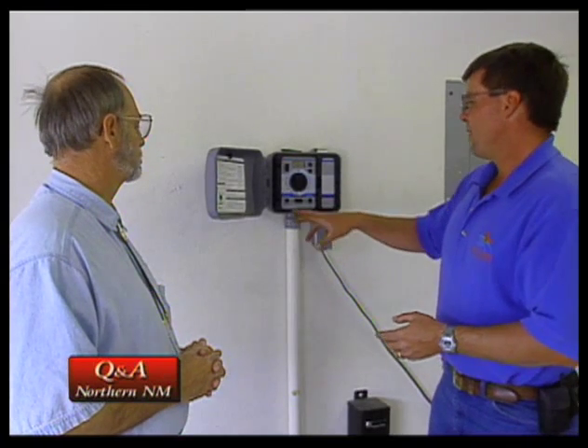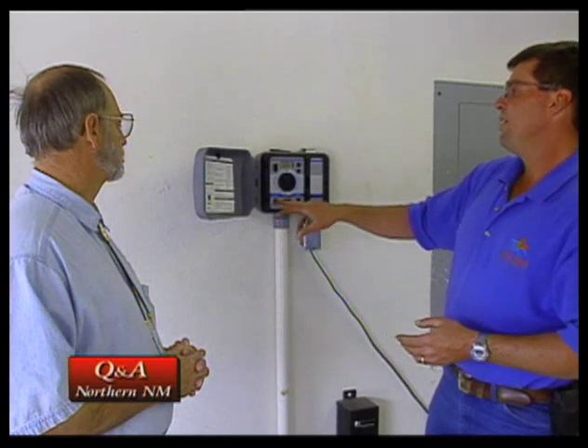However, there's a reason to do it manually. People need to know how to turn it on manually and see what to look for. In Albuquerque, we're not even allowed to water between 10 a.m. and 6 p.m. during the day, so a lot of times people do program their controllers to come on at 3 or 4 o'clock in the morning — that way they run before you get up and take a shower. On commercial properties, those irrigation systems are checked pretty much weekly. For residentials, a minimum every two to three weeks, you should really go out and turn on your system. If you're checking your system under Albuquerque's law, that is allowed as long as you are there servicing your system. In this particular controller, all you have to do is go over to this button that says Semi-Auto, push on, and the system will go through that cycle and you can check your entire system.